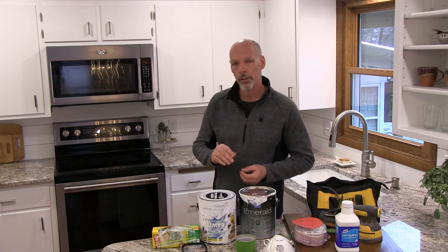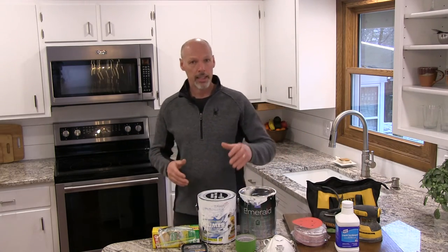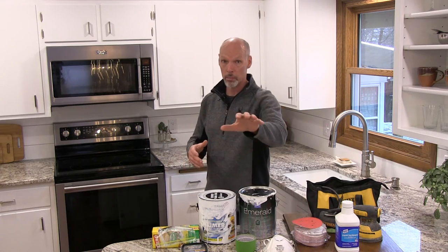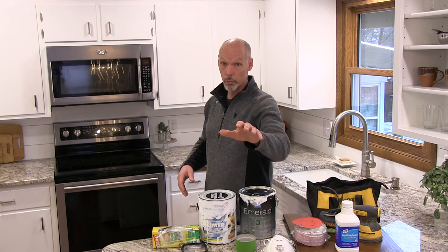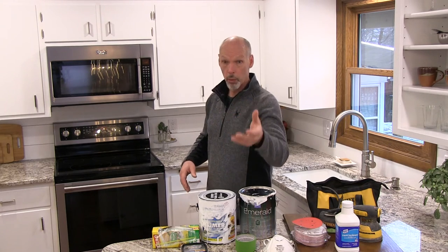Number nine: allow more drying time than what's recommended by the manufacturer. A few days after finishing, I was installing hinges and noticed a slight impression in the paint from handling it — it just hadn't fully cured. The beauty of this paint is that it cures and hardens, but you need to give it time. When you put that top coat on, wait two to three days before the next top coat. Then after the final top coat, wait a week — even two weeks — before handling or installing. We waited about two weeks and it worked fine.